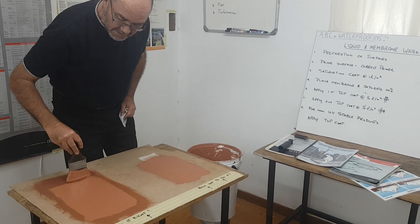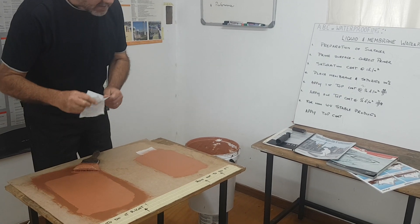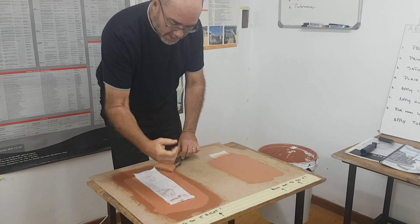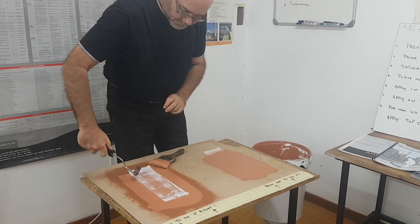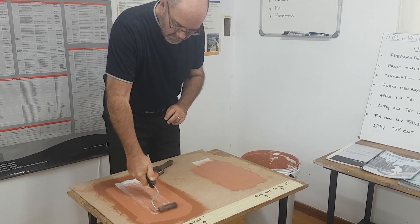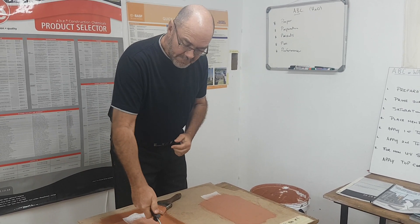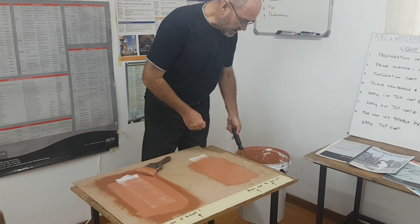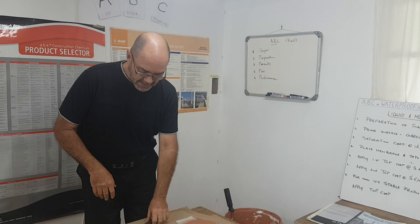On the board or tile or roof we can see quite enough, and now the crucial phase where I'll be putting down my membrane. Instead of a brush, for my demonstration I use a fluted aluminium roller, and this ensures that the liquid pulls through the membrane from the bottom up, giving us full saturation.